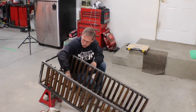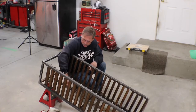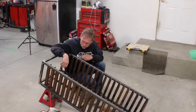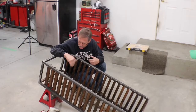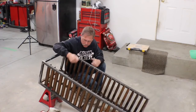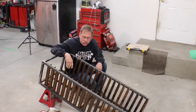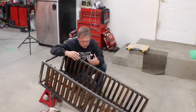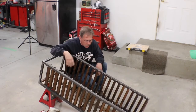I'm going to use a piece of angle or a piece of strap to go from side to side across here and just clamp that to it, so that as I weld them, it's staying straight and staying perfectly in line. Because again, I used my jig to put these on, but there's enough variation in there that it's just off just enough to not be as good as it should be.